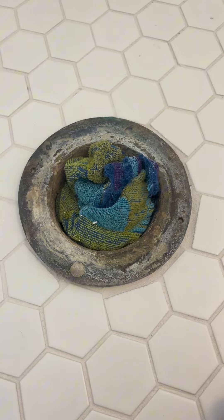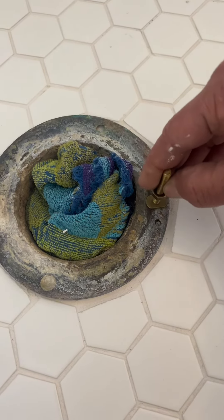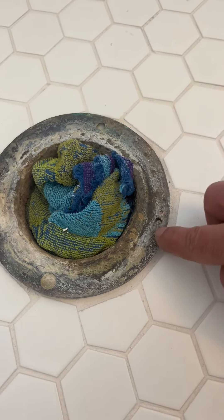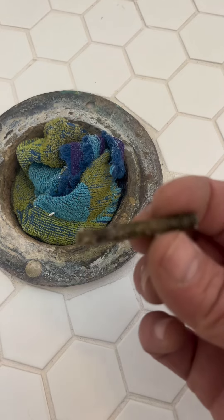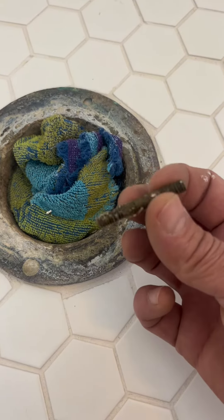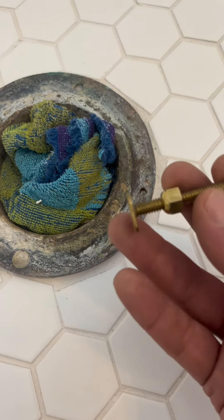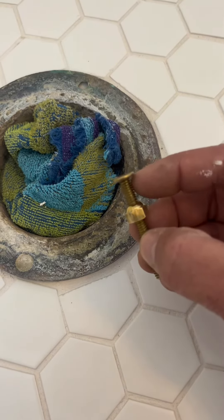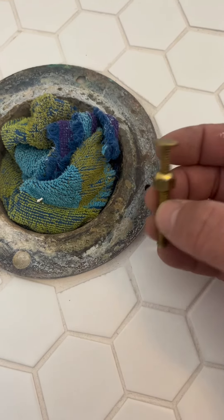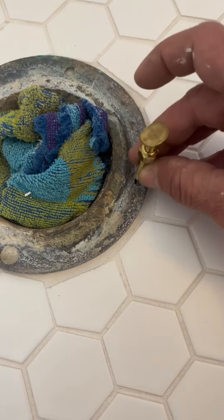This is a very old toilet flange, and there are no slots to slide this into place and hold it — you have to just screw the end in. These are the old bolts and I'm not going to reuse them. For some reason the store didn't have anything except bolts with a plate, so I'm going to grind that off. But when you grind it off, you might end up hurting the thread, so I've already put the nut on.